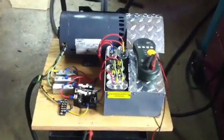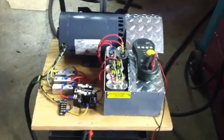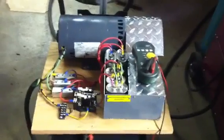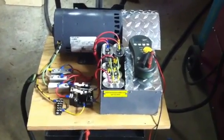What I'm showing you here is just a real basic way you could make a three-phase rotary phase converter, just using some off-the-shelf or surplus parts. All you need is an induction motor that'll handle your load, a few capacitors, and a normally closed contactor.